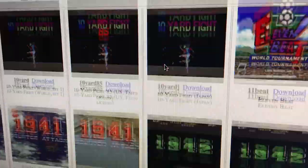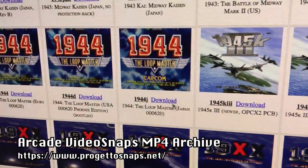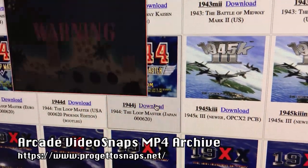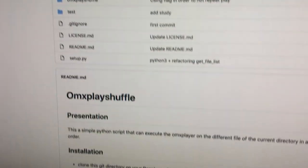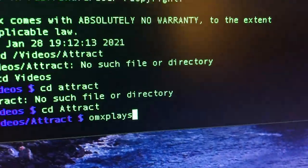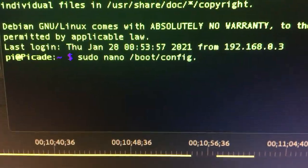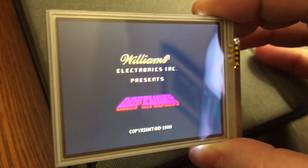To that end, the first thing I needed to do was find some videos of my favorite arcade games. I found a website that lists small videos that people who build their own arcade machines use as a library of thumbnails to preview their collection, and downloaded around 40 of the best. I found a script that would automatically play videos from a specified folder in a random order, and altered my boot config to launch that script on startup. So now when you power on the machine, it starts playing back the videos automatically with just a couple of seconds of black screen in between.